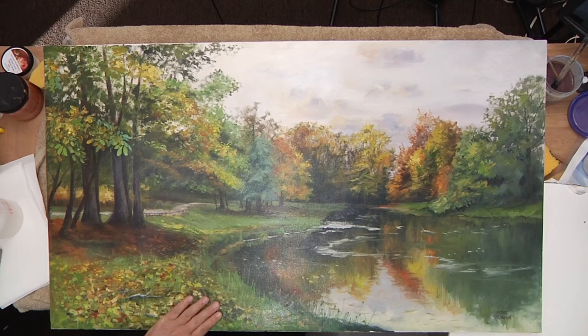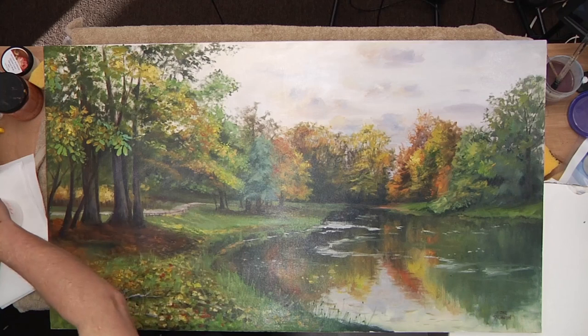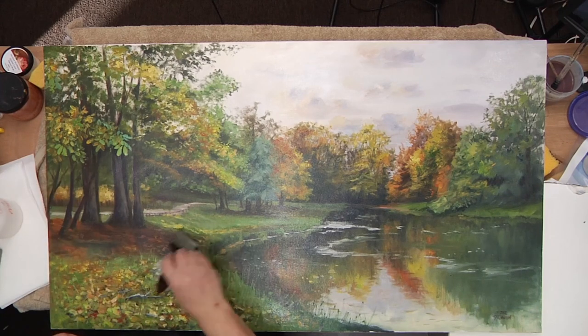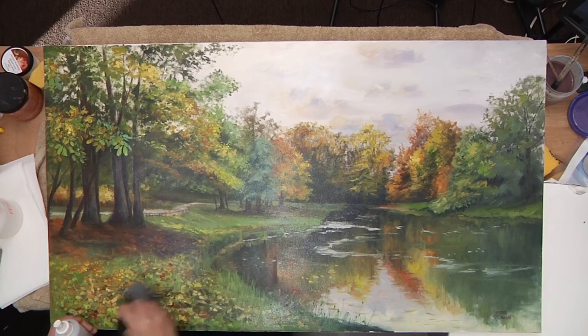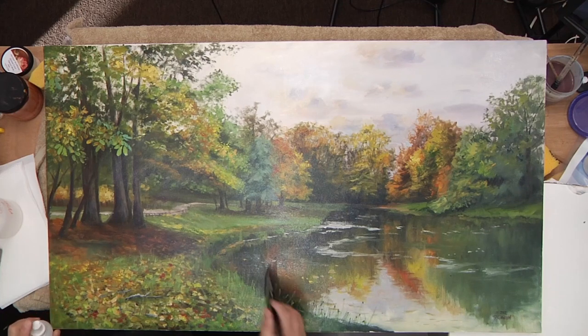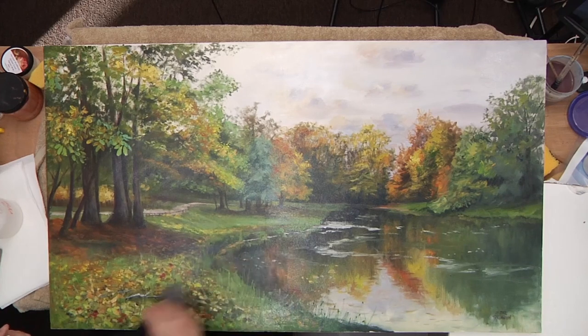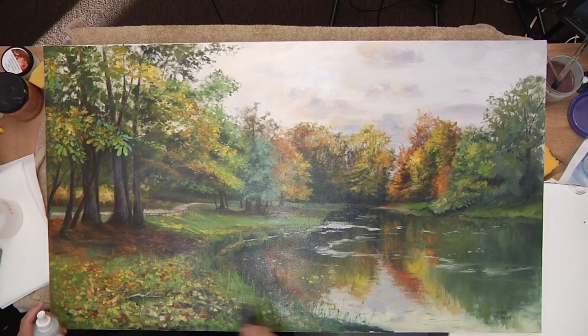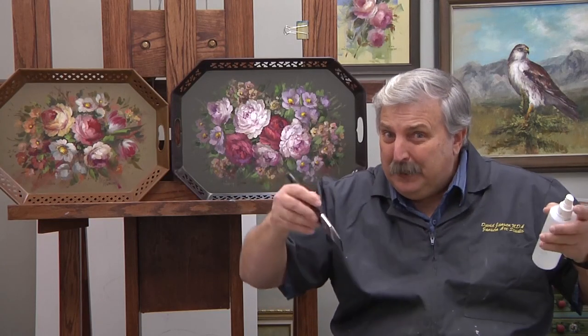Now, back down here with all this talking, this little edge right here is dry. Here's where there's no varnish. I don't need to worry about it. I just come right into here and just keep going. If you're at all worried about it, there's nothing wrong here, but just give it a quick little mist. That adds just a little water and causes the varnish to move a little quicker under the pressure of my brush. Or if your brush starts to feel a little sticky, mine isn't, but if it does, now, I like it to be a little sticky. I like the little bit of drag.